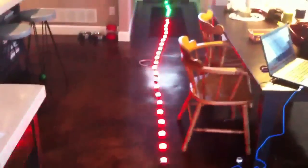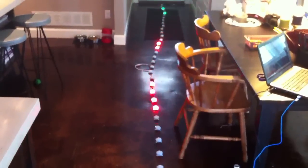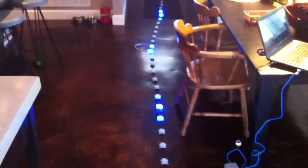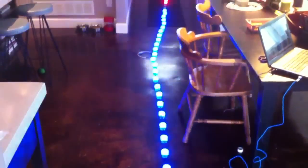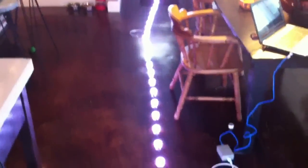I'm going to go ahead and start my sequence up here and show you what these will look like. What I'm showing here is actually two of those strings, so about $96 for this pixel string. But this is 40 pixels, whereas a firefly is only 16. These are also 12-volt, so you don't have as much drop in them and you don't have to worry about re-injecting power as often.